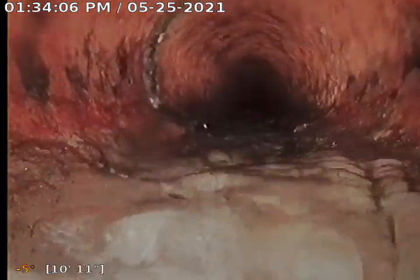We'll be curious on the pullback for that area where we had a little bit of standing water to look at that again with the water off. If everything drains out of there, then you're feeling better about things. And again, you're seeing some pretty heavy deterioration where the two joints of pipe come together. So at the two points here, top left-hand side of the screen, you can see some pretty good deterioration.